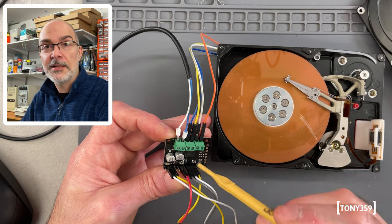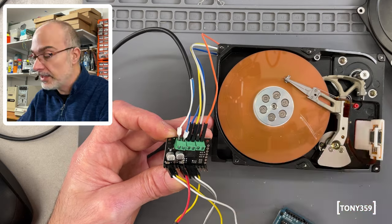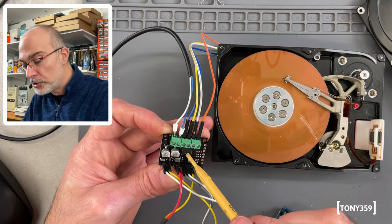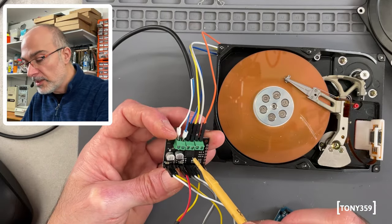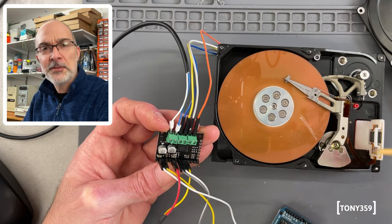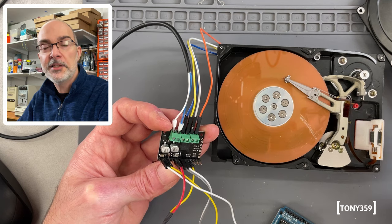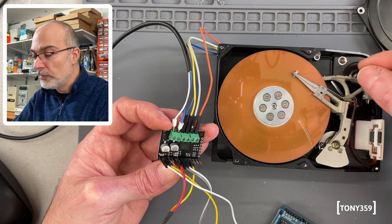So what I found is that whenever the limiter on this little controller board is actually limiting, it causes the motor here to make this noise. And I got in touch with the manufacturer. I think it's a Toshiba IC, but in the end, this is manufactured by this company called Pololu. I checked online, I asked around on some forums, and it looks like this is kind of unavoidable. It's not entirely clear, but the reason why the stepper motor is still energized when it's idle is to prevent the motor from moving like I'm doing now.